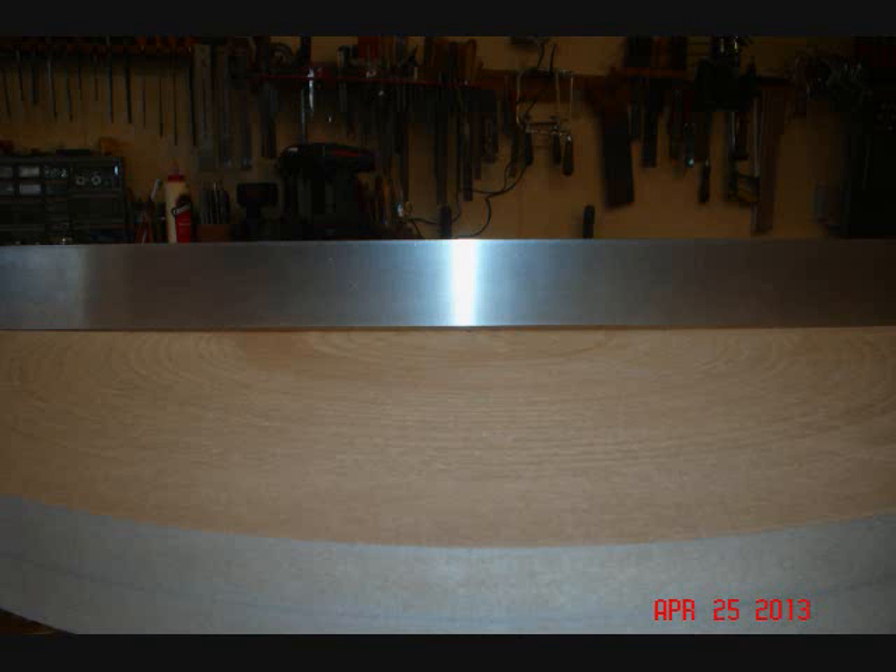And here we are with the dish formed at a 40-foot radius. At this point I'll sand this out a little bit to get some of the roughness left by the router bit, and then after several coats of varnish to seal it up and harden the surface, I will glue a large sanding disc in the center so that we can use that as a gripping surface. I also use that to sand out braces and various parts that need to conform to that exact same radius. Very handy tool — about two and a half hours to build it. Check back again for my next presentation, which will be: where does a Ledoux guitar begin? We're going to start just about from the tree. Thank you for watching.